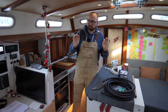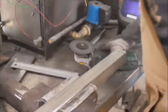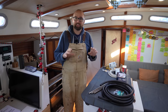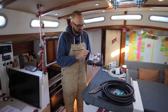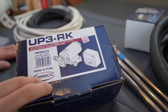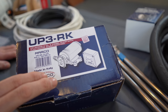It's the next day. The 8mm fuel hose is still suspiciously absent — that's the stuff I need for the DIY fuel polisher — but I do have everything else to get started on the fuel transfer. Here under the kitchen island we have a 200-liter diesel tank secured to the same stainless frame the kitchen island is bolted to. Before installing the kitchen island, I ran hose back to the technical compartment so I could hook up the tank at a later date, and that date is today. The tank doesn't have a deck fill, so the only way to get diesel in and out is to pump it. With the UP3RK pump, it should take about 13–15 minutes to completely fill or empty the tank at 15 liters per minute or 900 liters per hour. I'd like to add a filter, but I haven't found a good option for a filter and water separator that can keep up with that flow rate.